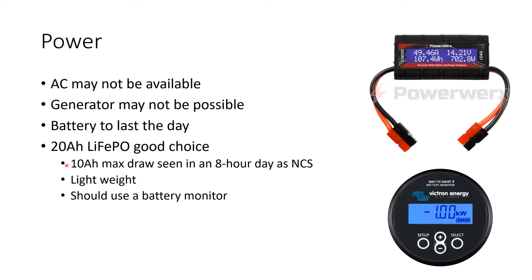The max I've ever pulled out of a radio running 50 watts all day long for eight hours is 10 amp-hours. So if I put in a 20 amp-hour battery I've got roughly 16 hours — more than likely. That may be temperature dependent, but 20 amp-hours in general will give you a good working battery. Another nice thing about LiFePO4 versus lead-acid: they're a third of the weight, so they're a lot easier to haul around.